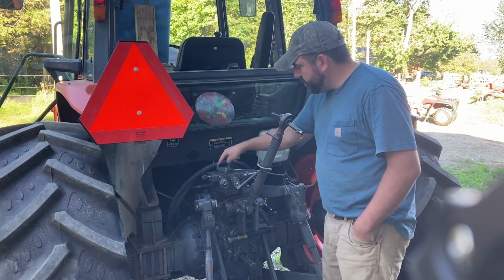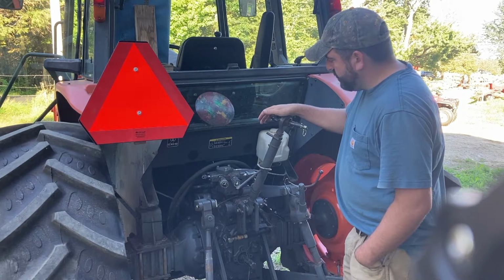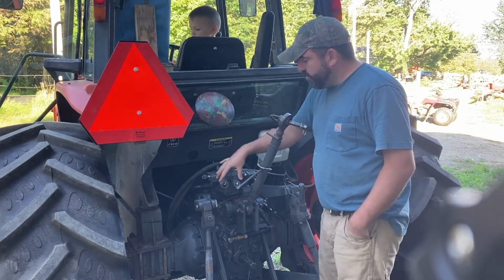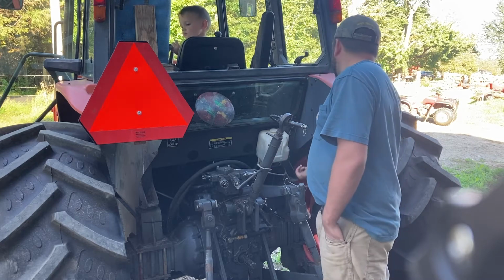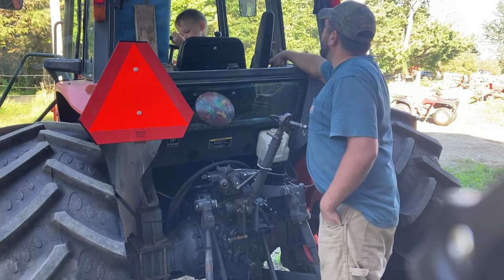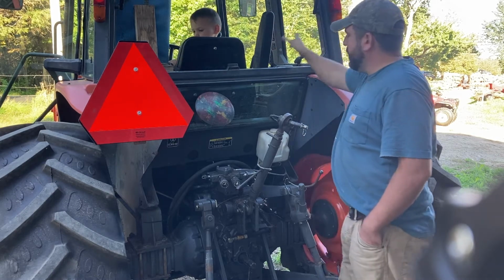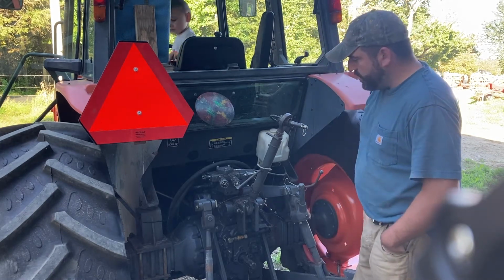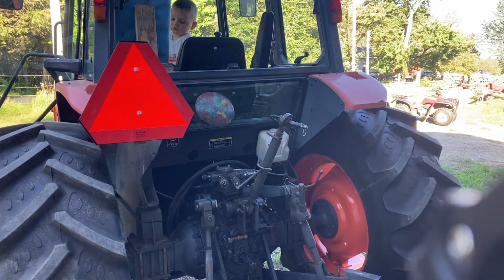The top bolts, there's 3 of them. Those get replaced with studs, and that's pretty much it for adding the actual remote itself. The controls get a little bit more interesting because you have to run a cable up through under the cab and add another lever to the hydraulic right here, up high for the actual control. And that's what we get to work on. So I am going to dig into that next remote box.